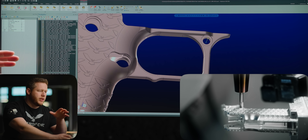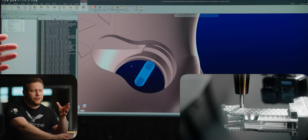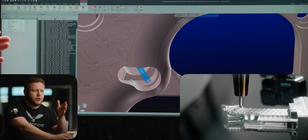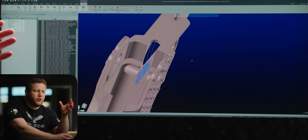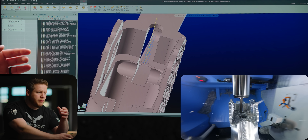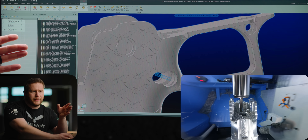After that's done, we're going to come in with the larger tool and helical bore out our mag release hole. You'll notice I've got a flat bottom in the bottom of this, so that's why we're not just drilling or boring it all the way through — there's actually a flat bottom down there. Next we're going to step up and rough the rest of this slot down to the bottom for our trigger, then come back in and finish the walls. Then I'm going to spiral back down through this mag release hole to make sure there are no burrs. It might take a little extra cycle time, but it's a lot more efficient to add another pass for burr removal than to do a whole lot of post-processing on your part.